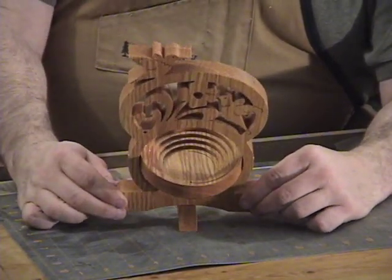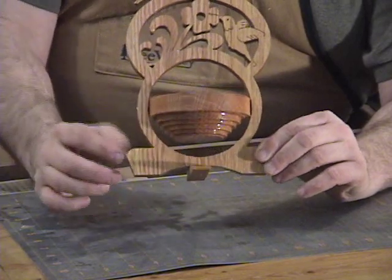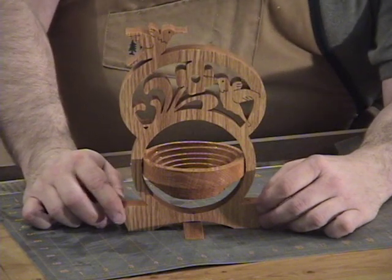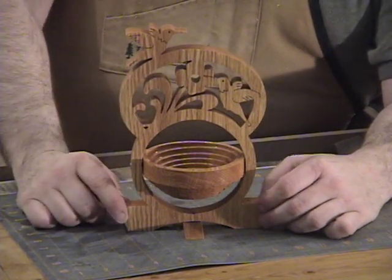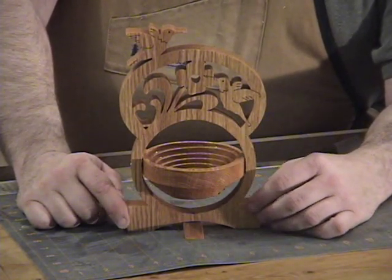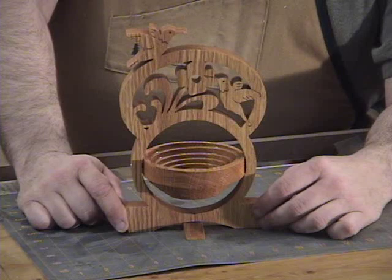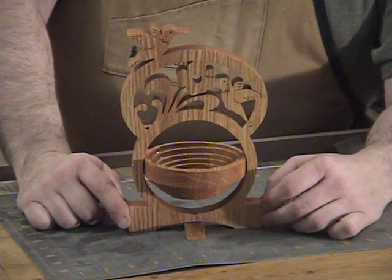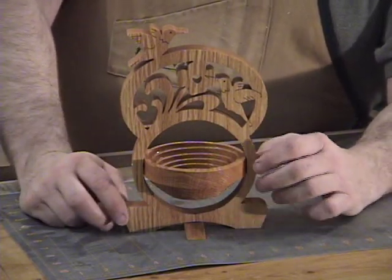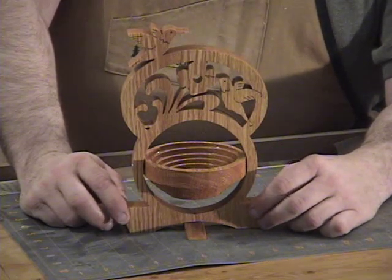The basket is actually a spiral that's cut into the pattern and it allows the wood to open up once it's finished. What you'll do to make this happen is when you cut this pattern, when you get ready to cut the spiral, you will set the table on your scroll saw to an angle of somewhere between four and a half and six degrees on this three-quarter inch material using a number seven blade. If you change the width of material or you change the size of the blade, the amount that this bowl is going to open up is going to change. I'll show you in just a minute that you want to do a test cut to make sure you've got the depth like you want it to be.